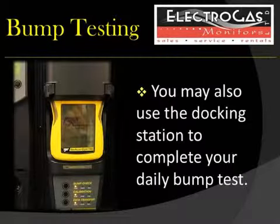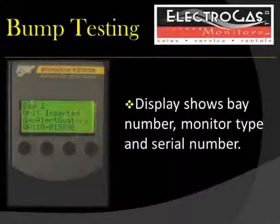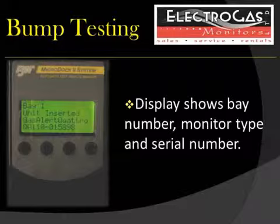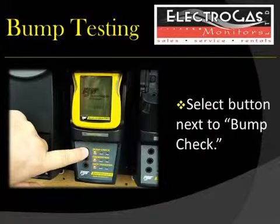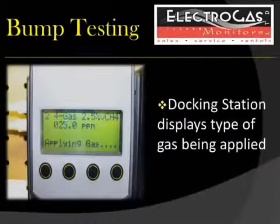If you wish to use a BW docking station, insert the unit into the station, face up, and fully close the test bay. The display will show bay number, monitor type, and serial number. To begin the test, simply press the button next to Bump Check on your test module. The display will then show the type of gas being applied.